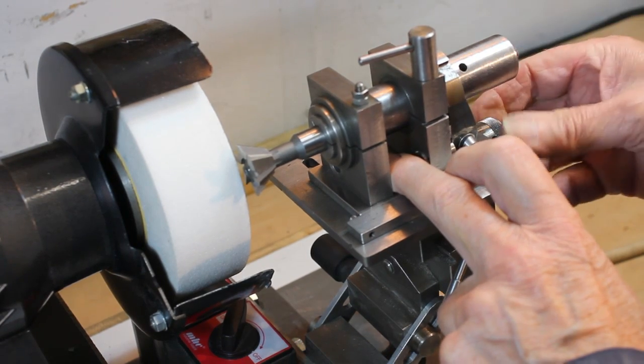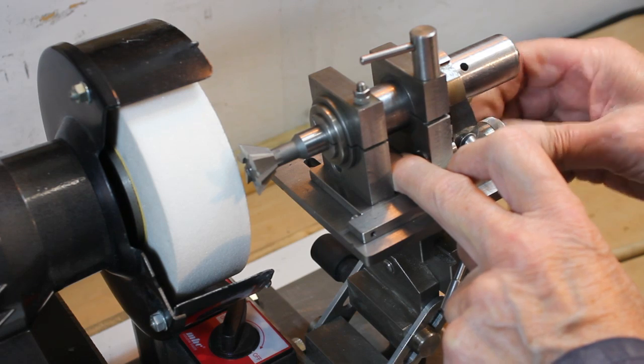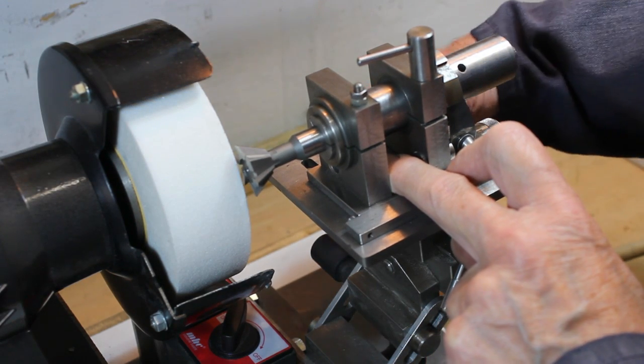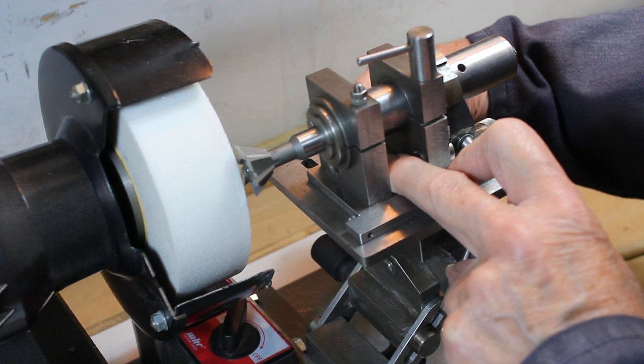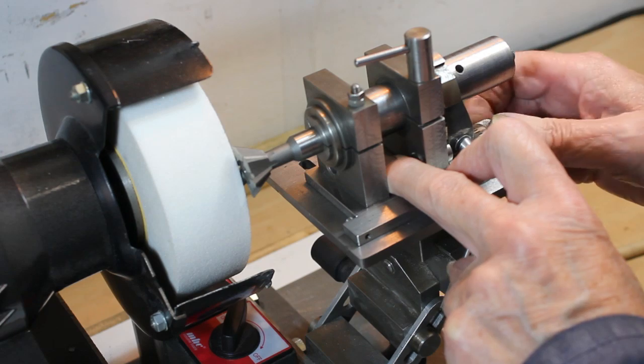This adjustment sets the amount being ground away. And this adjustment ensures the cutting edge is fully ground whilst ensuring that the adjacent edge is not ground. However, this can only be achieved aided by the curvature of the wheel. Because of this, the table has to be set quite high. Now for the simulated sharpening.